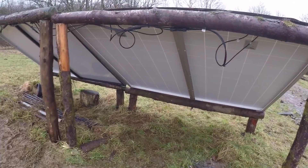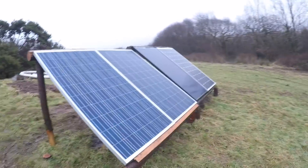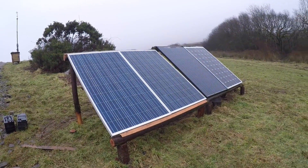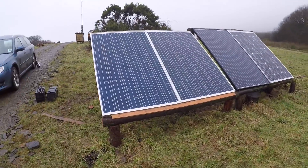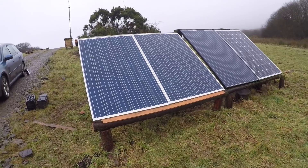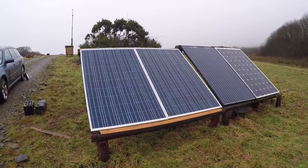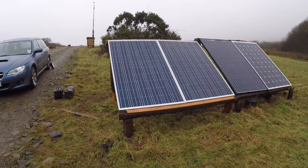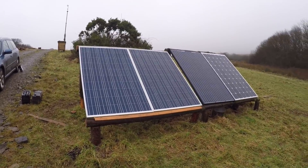There's a nice little solar upgrade there, wired up with proper connectors. Sorry about the wind. That's just over a thousand watts — one thousand and twenty watts exactly, which is what the charge controllers can handle, so that's maxed out now. There's no sun at the moment so they're only pulling in about an amp, but when the sun comes out it'll be a thousand watts, which is lovely. Hope you enjoyed this video, thanks for watching.